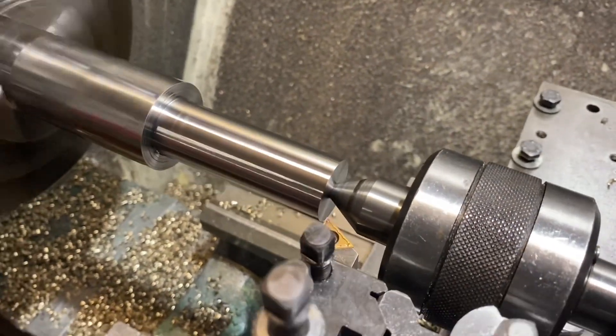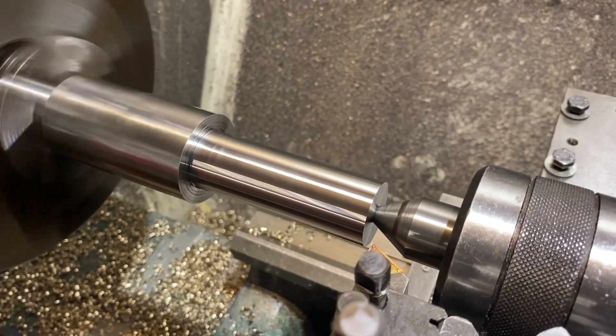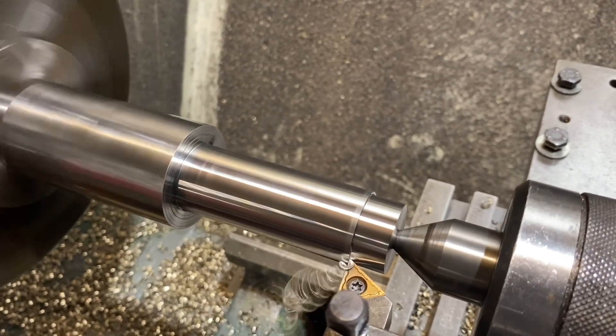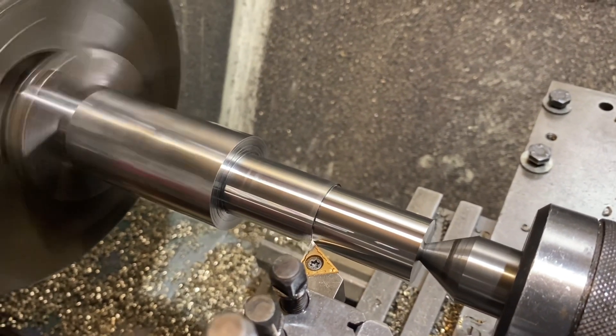So, finished cut - this will be 24mm when done. We're up to 1252rpm but we're down to 2mm depth of cut, that's 1mm off per side. You can see the chips are getting a bit lively now, but it's only one cut so it's fine.